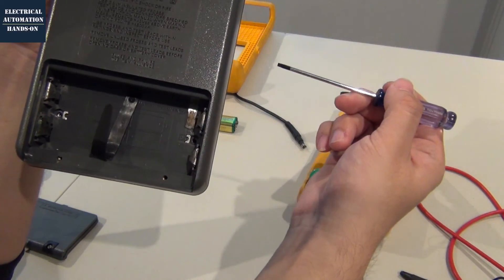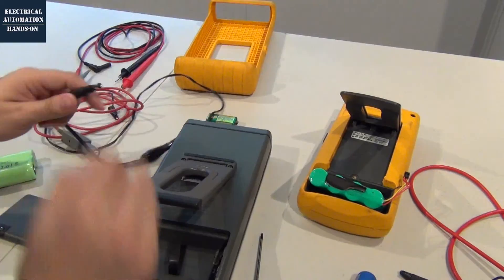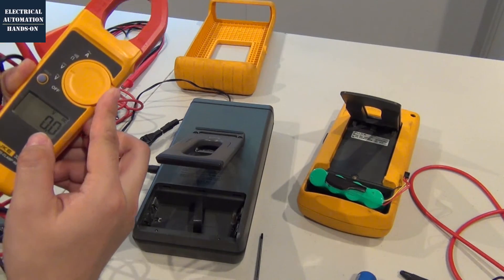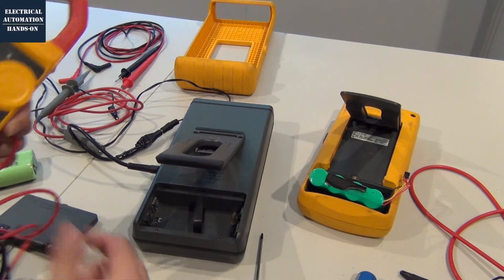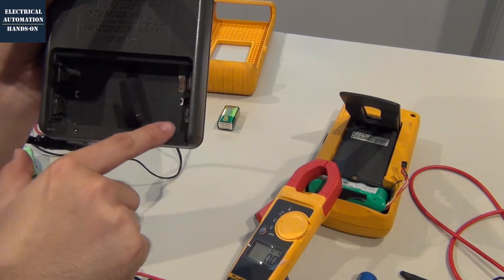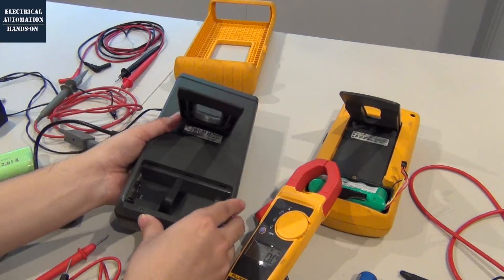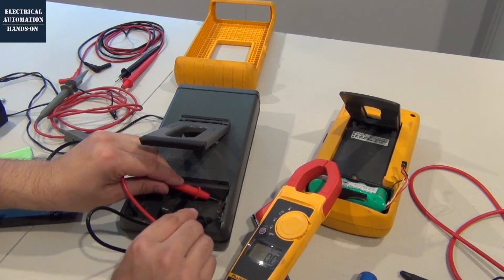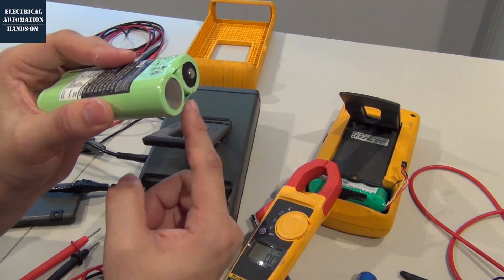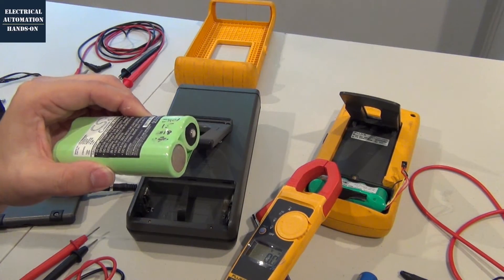The reason is from this internal design. When we connect the AC power to this scope meter, the power to charge this battery pack comes from this metal lug. So now if I connect this AC power to this scope meter without turning it on, I'm going to use this clamp meter, switch to DC voltage, and measure where that power comes from. According to the symbols on this battery pack, this is the battery positive and they are connected together; this finger is the negative of the battery. Let me measure the voltage from this metal lug. So let's see — that is 8 volt. That means if we put a battery pack here, this battery pack should have a metal lug, and when you load this battery inside this case, through that finger it will charge this battery.